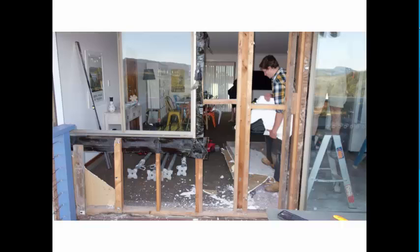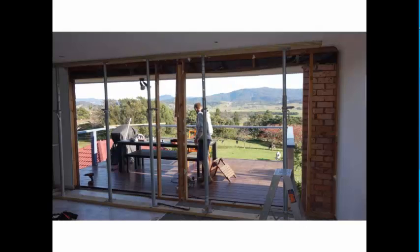You can see the guys have taken off the cladding and the plasterboard or internal linings. They've acro-propped to keep the actual load of the roof above — it was a truss roof. They had some engineered details that they could get 5 acro-props across to support that.